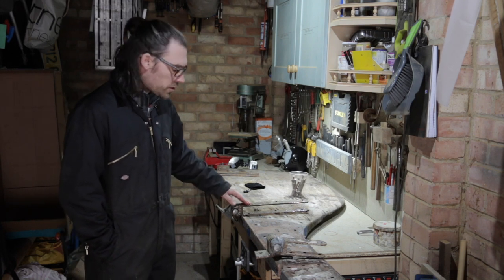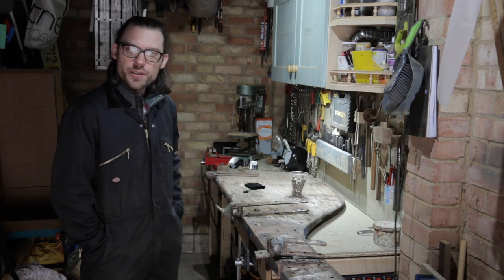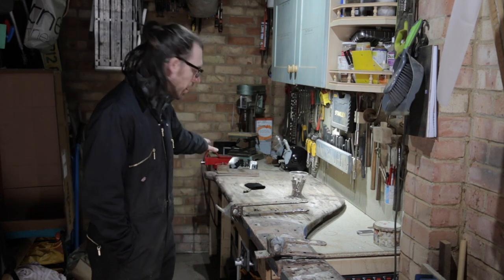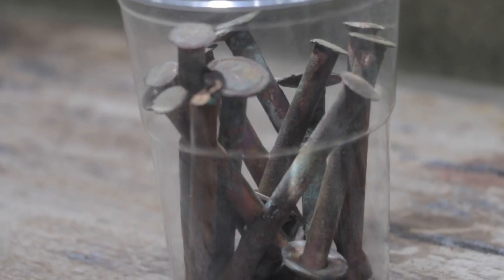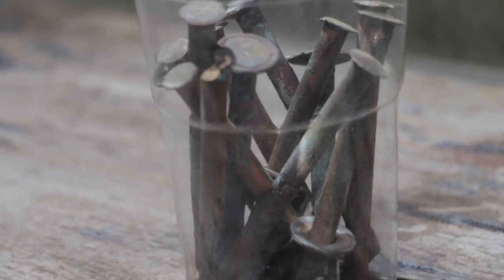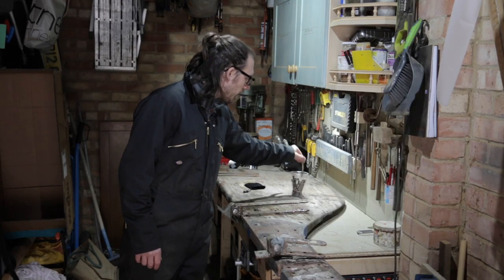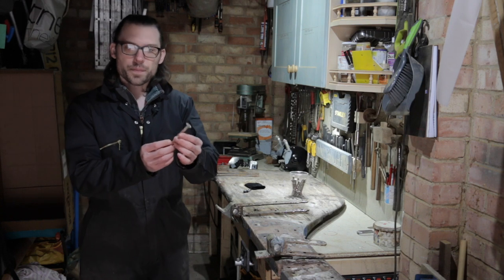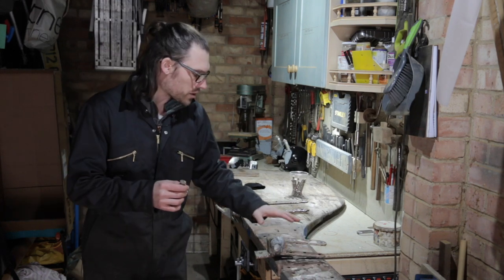These old straps were bolted on with hex head bolts that stuck out of the side of the rudder blade here and lower down quite far. A friend of mine has talked about the idea of these straps being traditionally fastened with copper rod that's sort of mushroomed over. These are the old fastenings that were used to hold the cheeks on the rudder stock up here.